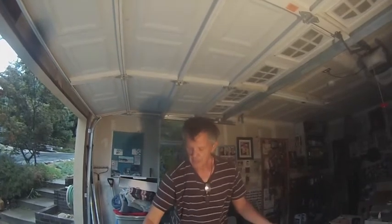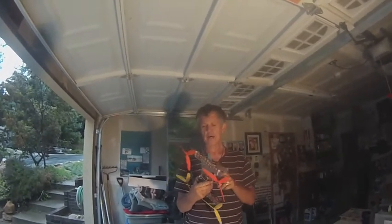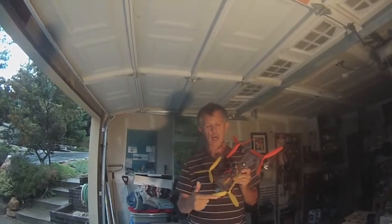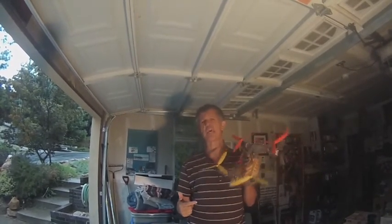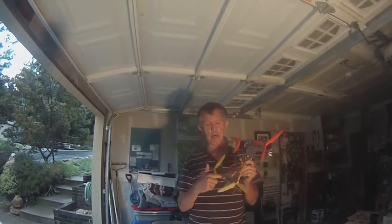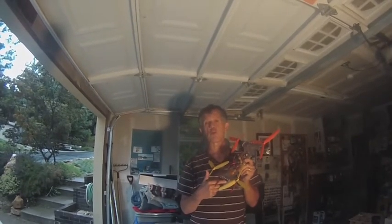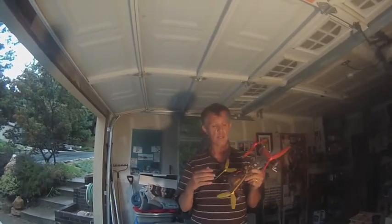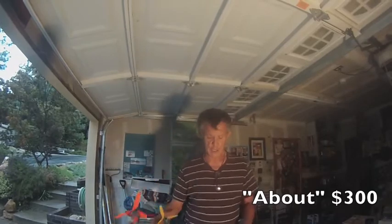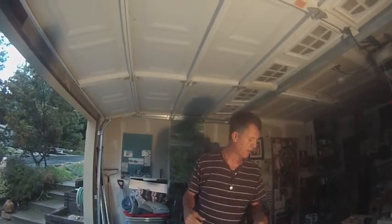The reason is because this is what we call a ripper. Me and my buddy Terry live here in Colfax, California near Sacramento, and we build these things from scratch — cut the Lexan, put the KK2 board on them, three-bladed props with 900 KV or better motors, and just tear it up. Hit the brakes, do full 360s, flips, the whole bit. The Lexan body on this H-frame is virtually bombproof. If you want to build your own frame, consider cutting Lexan because you can't hurt it — you can roll it on asphalt and tear up all your props but the frame will still be intact. This one's for tearing up the sky; the Phantom is for video, nice gentle panoramic views with my Fat Shark goggles.